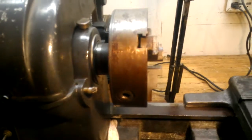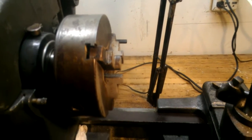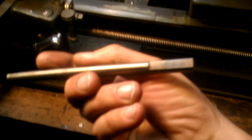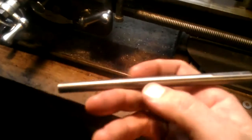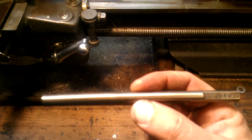I'll have to make a center I can put into the chuck, and I'll turn it so it'll be running perfectly concentric. I've got this little gizmo back here - I made myself an arbor. This thing is made for 375 thousandths, which is three-eighths. Right about here in the middle is pretty close to where it hits three-eighths.